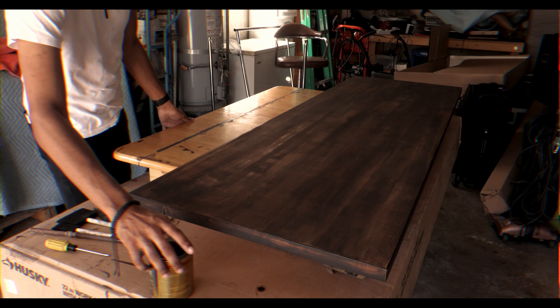To make things worse, I thought it was okay and just poured more stain on the wood, which also didn't soak in — leaving a sticky, terrible mess. After a couple of days of the stain not soaking in, I hit up my friend Darian. He came over after an eight-hour wedding day we both had worked, and we sanded off all the stain — which was heartbreaking — using light 220 grit to remove the bad stain and the original coating. That added another week to the process.